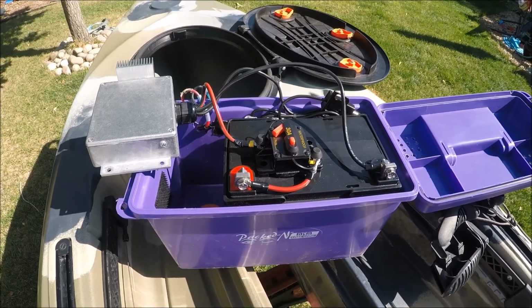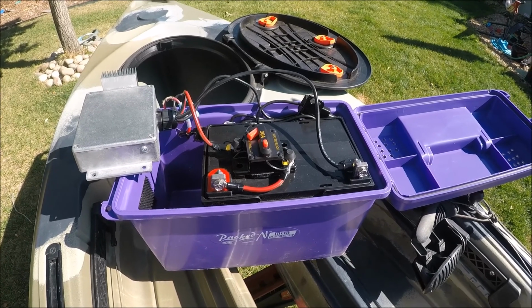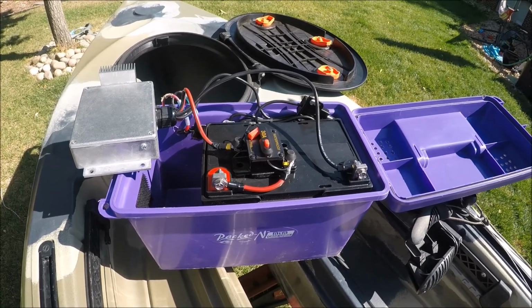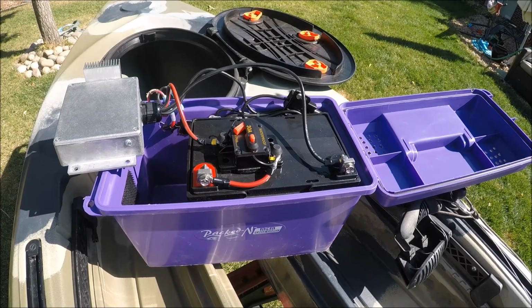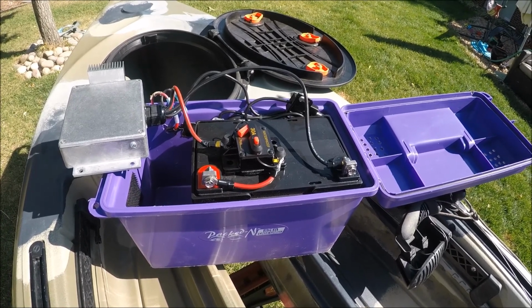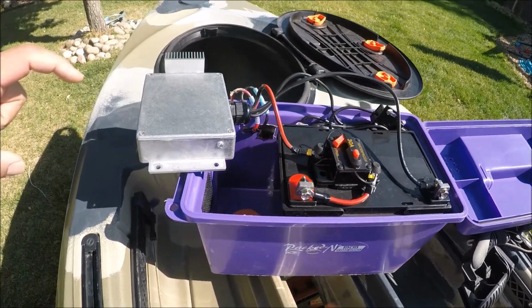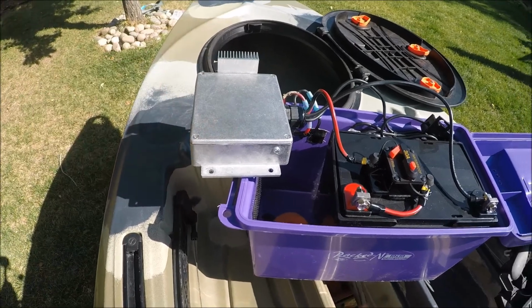It's super, super inefficient. That's why it kills your trolling battery so fast, people. So this was a way that I could take a smaller battery and get it to last all day. Because when I'm using 10% of the power on the trolling motor, I'm using 10% power on the battery. So once again, drawing 10%, using 10%. Much more efficient because of this speed controller.